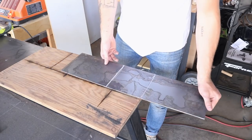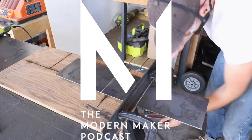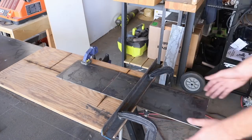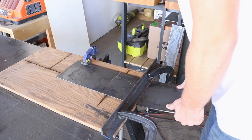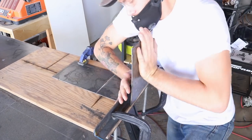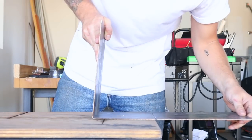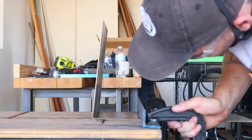This bending jig was based off of one from my podcast partner Ben Ueda, The Modern Maker Podcast — links in the description. Essentially, I just clamped a piece of angle iron inside of the groove and then I was able to bend the metal in place with that holding it flat. Because I cut that groove, enough of the material was removed that it was easy enough to bend by hand, which was super convenient.